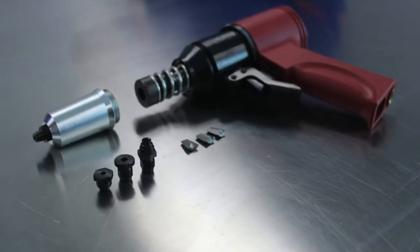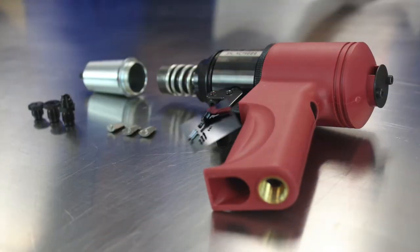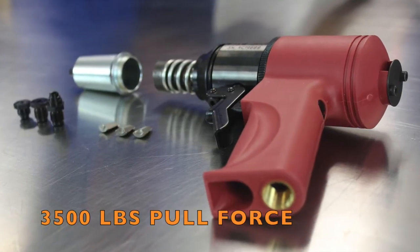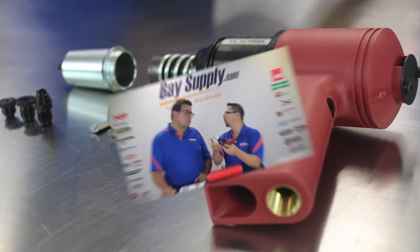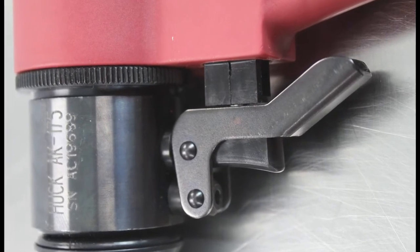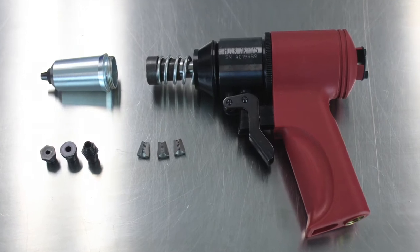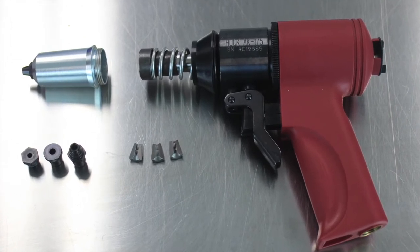Why don't you give us an idea of some of the typical operating specifications for this tool. It has about a 5/8 inch stroke and a 3,500 pound pull force. It does rivets from one-eighth to quarter inch, and it's got a really good grip. We have here our pull trigger and our release trigger. You use this long release trigger to let go of the spent mandrel — or the nail, as some people call it.